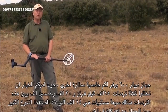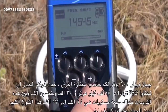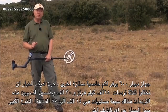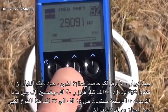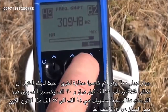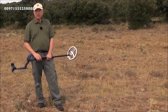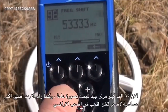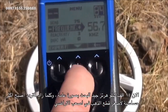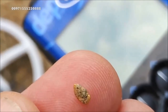The Deep R600 offers another big advantage: a choice of three frequencies — 15 kHz, 30 kHz, and 50 kHz — with a further seven steps in between, giving a full range of 14 kHz to 57 kHz. This suits a wide range of search scenarios and also eliminates EMI interference from other detectors. The 15 kHz and 30 kHz settings are more suited to general detecting.